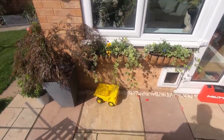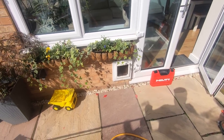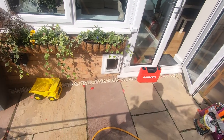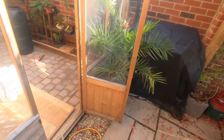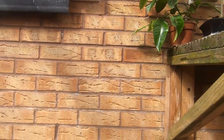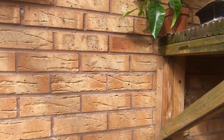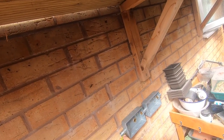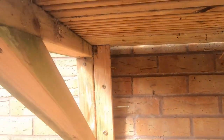So we need so much to go down the wall in there. So we'll measure that up, we'll release the pipe because we're going to have to cut that at a suitable length. So I'll just hook that on there and we'll measure how long a piece we need in here. So we're going to aim for no socket beyond here. So the two sockets will fill in that sort of space, a brick and a half maybe. So we need to bring our conduit that long. So allowing for a bit of thread inside the coupler, we want that to be about 34 inch.